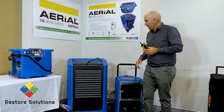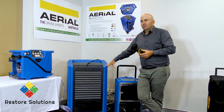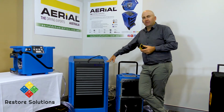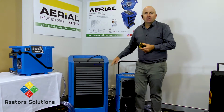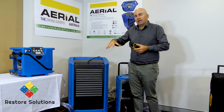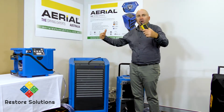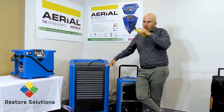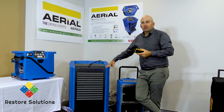So a lot of the times people say, well, is this low grain refrigerant or is this LGR? So no, it's not LGR, but it works at low grains. Well, what's the difference? Well, a lot of the times with LGR, the air goes down through the coils and, in some of the other brands of dehumidifiers, goes out the sides and then goes back through the coils. So it actually sometimes processes twice. So sometimes you get a bigger grain depression, but they have a different size fan.